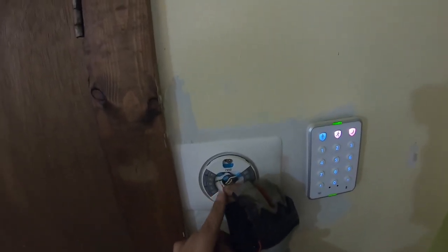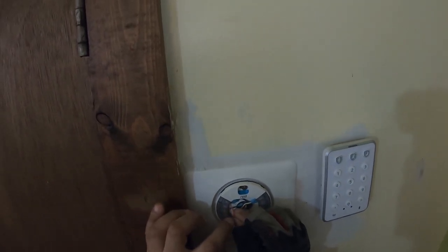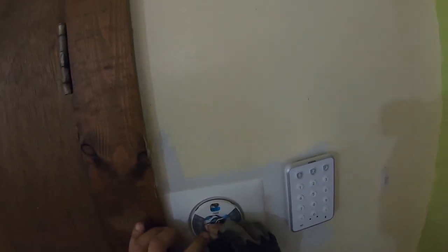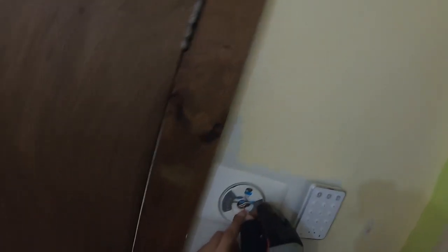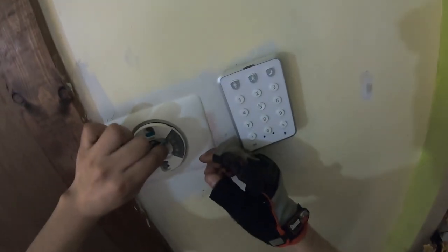How's it check outside? Yeah, it's on. It's on? Yep. Yeah, it's the thermostat. Do a hard reset, man. That thermostat? Yeah. The good thing is it's not the wiring, man. That's you saved the headache right there.